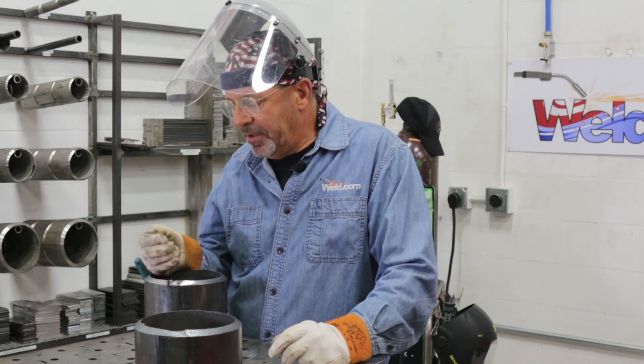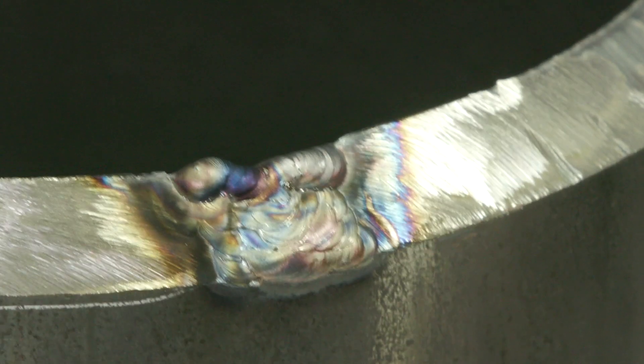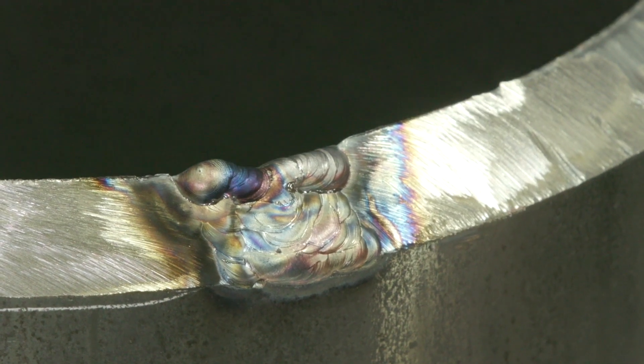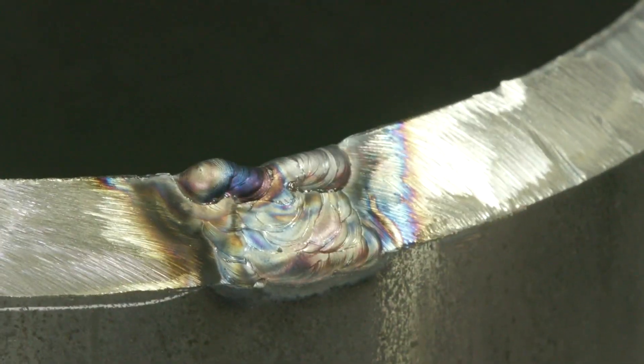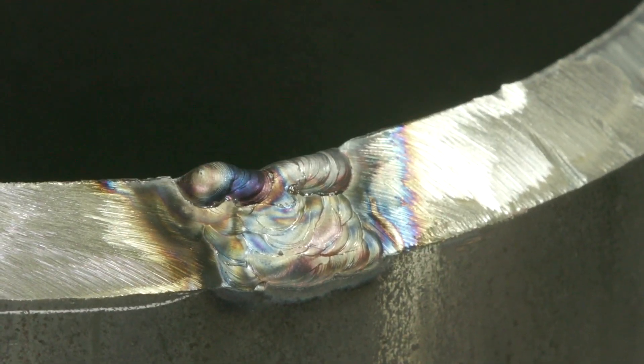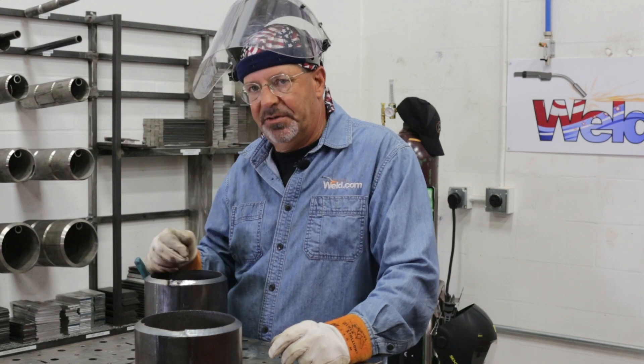I went ahead and made the repair — welded up this area, added a little material, it's built up there a little bit. We're going to take it right back off and try to bring it back to the original bevel angle. I want to reach in here and clean this area with a roll cone first, get the mill scale out of the inside of the pipe, come back, clean the face, and the last thing I'll do is put a root face on it.